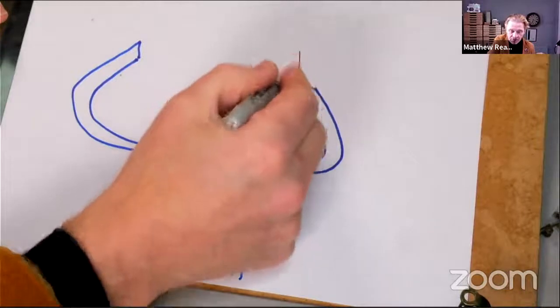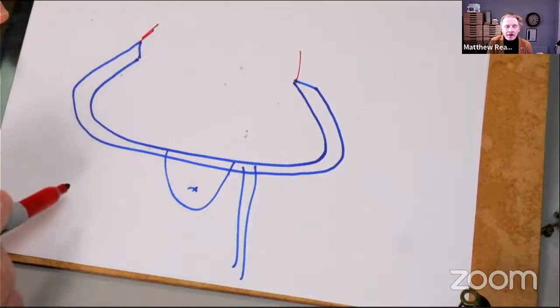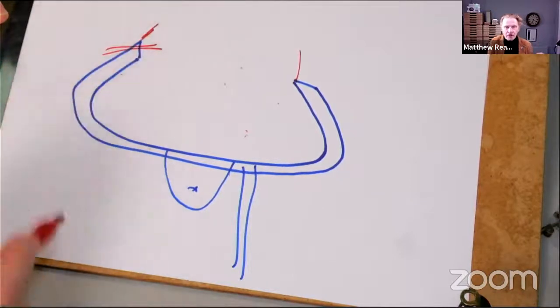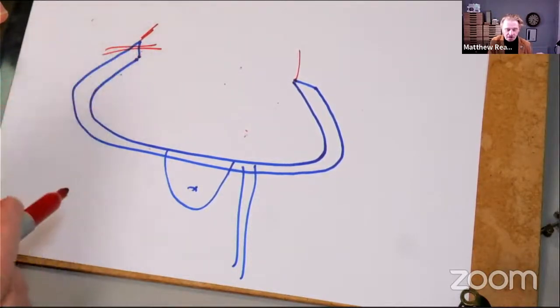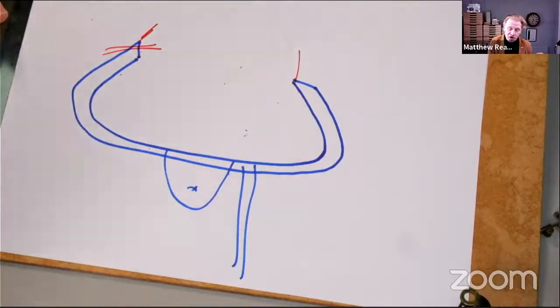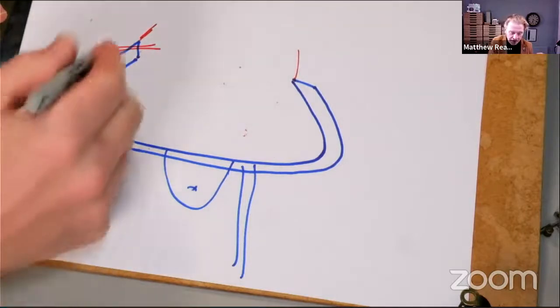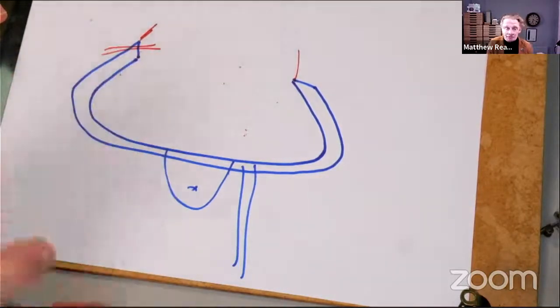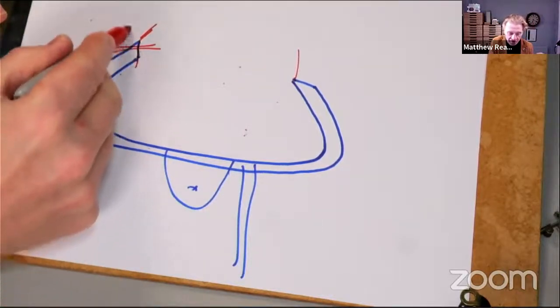But this one, I think what's happened is they've got it into such a state that when there's an escape wheel tooth here, this one is jamming on the back. So they've filed that down like that, which means there's about a third of the original impulse face. So what I'm going to try and do, and it may be a complete disaster, but we've got nothing to lose here, because if it doesn't work, I'm going to have to make a new pair of pallets and do a drawing and all that stuff,